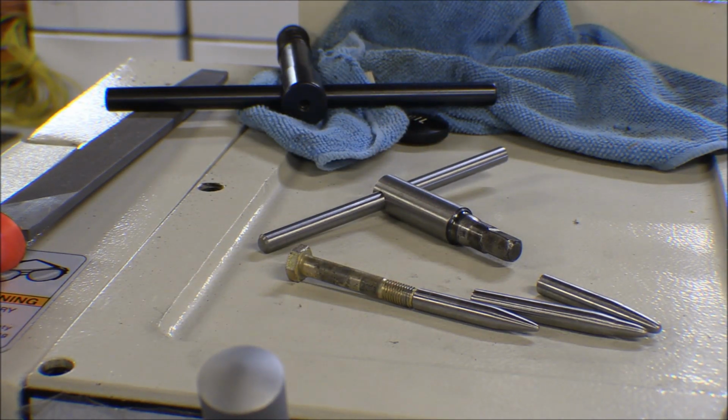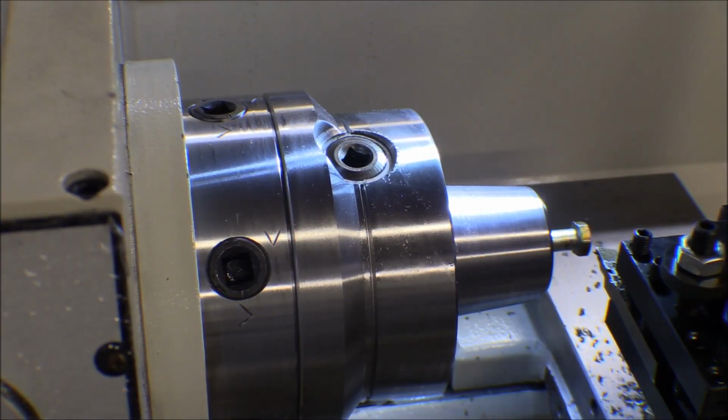I got some number 6 bolts down there and maybe a number 7. I'll go ahead and make some out of those. I've got a number 6 someplace, but I've misplaced it now. Well, as long as I'm in the mood here, I might as well make some more. I changed the collets, and I'm going to do some number 6s now. Number 6s are 3/8, so I took the 5/16 collet out of there, put a 3/8 inch collet in, and I've got my first bolt set up there to trim the head down to the shank diameter.